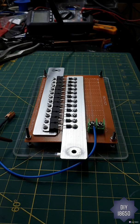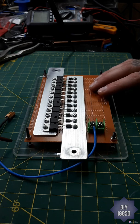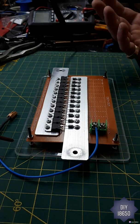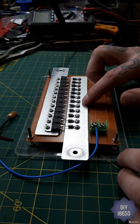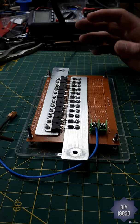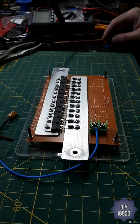Timing will be next — I have a bunch of different timing units and that's a whole video in itself. You can pair this up with a store-bought welder timer or something you can make yourself. Just make sure your timing is really low. I have to recalculate my timing because I base it off calculating the uF of my capacitor used for timing, which is 22uF, and I went with zero resistance in my calculation, getting about 0.22 milliseconds — which is insane, less than a millisecond. But the welder only had 0.1 ohms of resistance, so I have to recalculate. It might be more like 2 milliseconds or 22 milliseconds — I'll have to figure that out exactly.